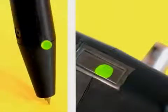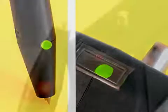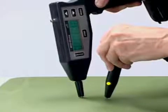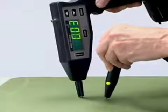In order to take a reading you must establish electrical continuity between the remote probe and the probe tips of the meter. There are lights on both the meter and the probe that indicate whether or not you have achieved continuity. Before taking a reading make sure that these two lights are working — when you turn the power on they should both light up red. To take a measurement carefully apply the probe tips of the meter and the remote probe to the area you wish to test. Press all four tips with light force only. You will know that you have achieved continuity when the lights of the meter and the probe turn green and the display panel turns blank. You must maintain contact with both probes for about three to five seconds. When both of the green lights flash together a measurement has been taken and will be displayed.